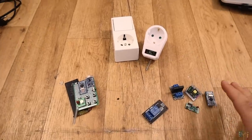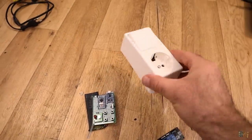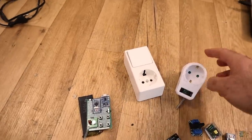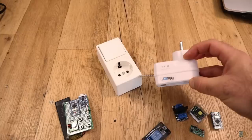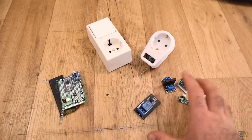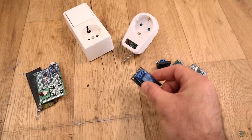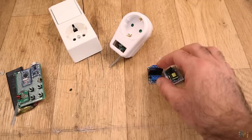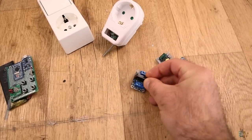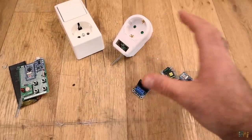This is the project right here. The receiver is inside this case and you can place it in any other electrical outlet, but you have to make sure you have enough space. This is quite small so the circuit is only inside this. I could use a coil-based relay but it's quite big, so I decided to use an SSR or solid state relay, taking it out of the PCB and soldering it directly on my circuit.